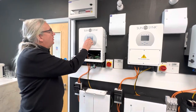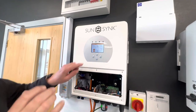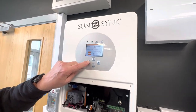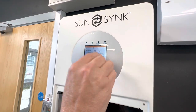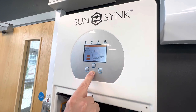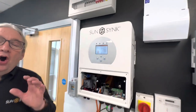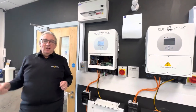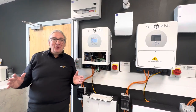One of the things you can do on our unit is we have an auxiliary load output, and we can actually set the level at which it comes on and off. We've got an auxiliary output here, and when it's 100% it comes on, and off at 95% — we can change those to other figures if we want. That's called the hysteresis: an on level and an off level. You often hear that term, and that's how ours operates. That's why the mini beast is the best on the market.